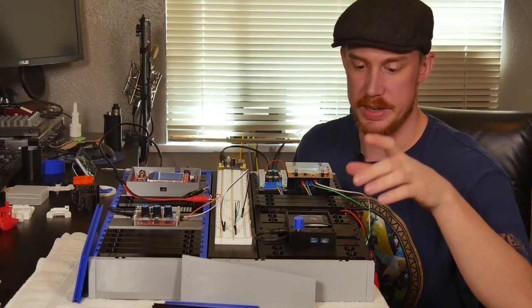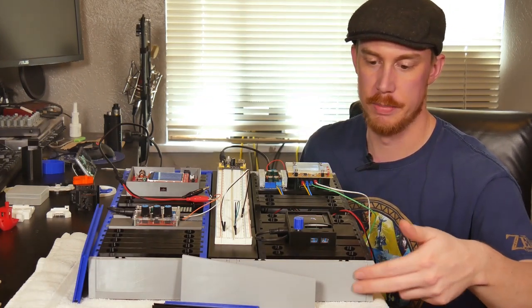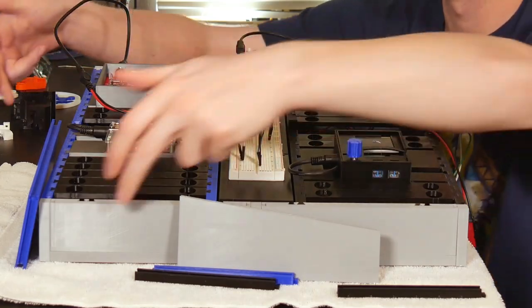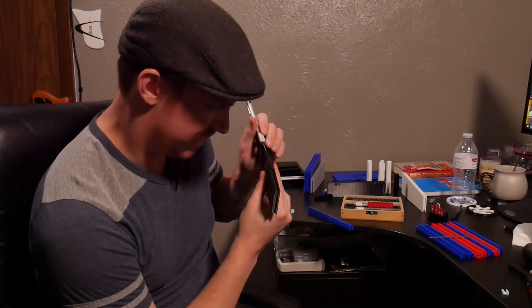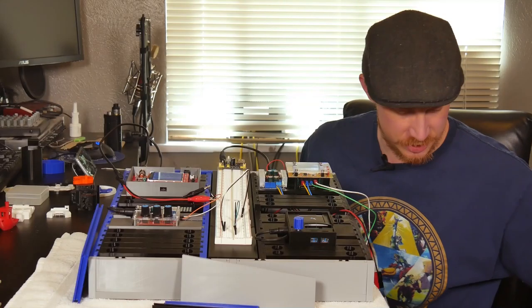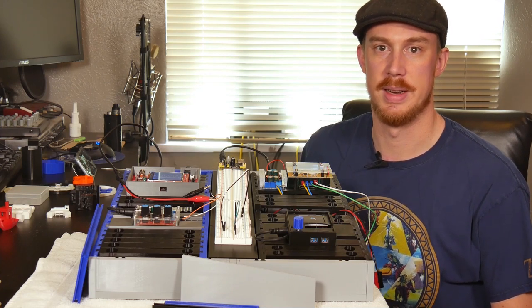But of course I wanted to ditch the idea of the feature printing on the bottom, because of those overhangs, as I found out the hard way with a lot of these pieces where you've got the bridging underneath, that material likes to sag a lot. And it took me at least an hour per piece that's got that feature to cut away all of that drooping material with my hobby knife and a set of mini files. It was just a disaster and hugely messy. I've still got bits of plastic sticking me in the feet when I walk around this room. No amount of vacuuming, I think, is ever going to get all of that plastic out of my carpet.